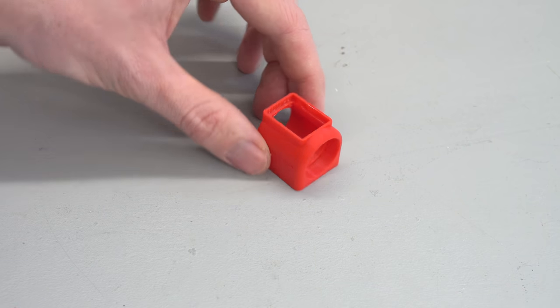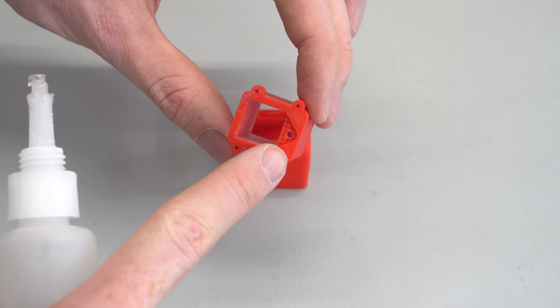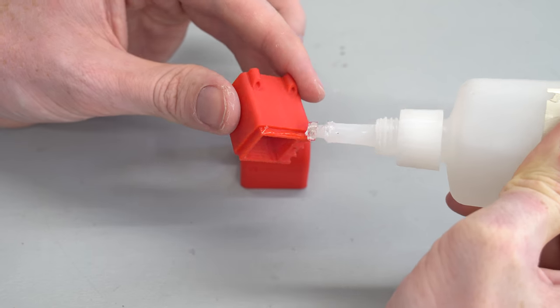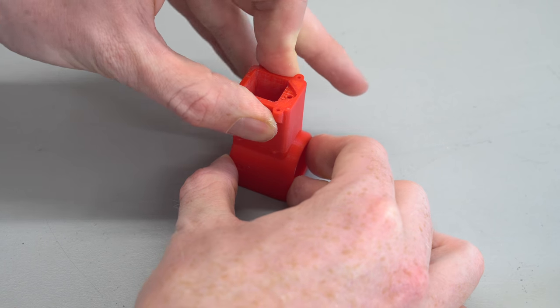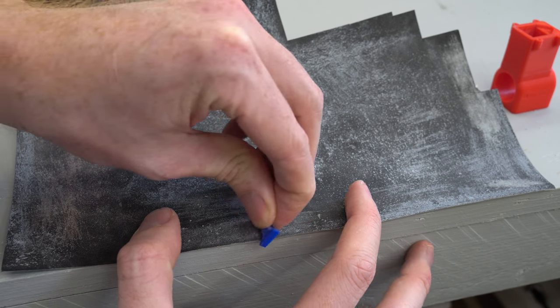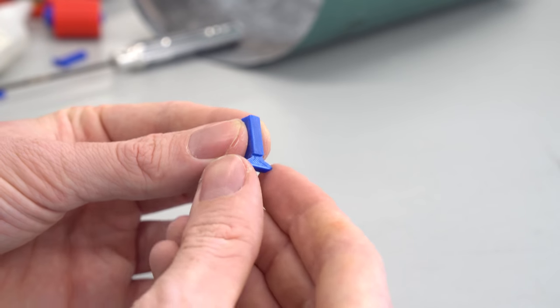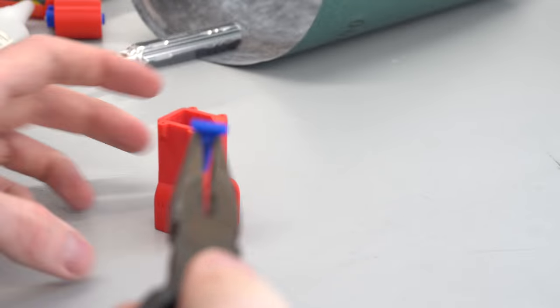Make sure to remember the front of the crankcase is the end with the larger diameter, and the front of the cylinder is where the pushrod goes. Use some CA, or superglue, to attach these two parts together in the correct orientation. Whilst the glue is drying or setting, sand all the main faces of the pushrod until smooth. You may notice that one side of the pushrod has a cutout, and this must be orientated towards the front of the engine.